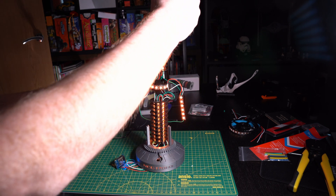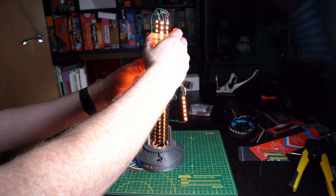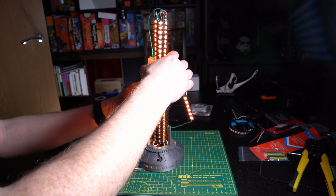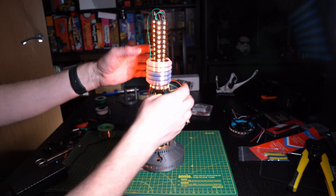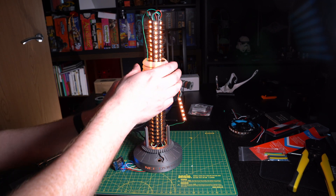Carefully slide the core parts over the LED baffles. You want to make sure you don't snag any of the wires as you go, else you'll be doing a resolder job. It's easiest if you hold the side LEDs which are kind of loose on the back, in the gap that's been made for the wires to run through. That keeps them out of the way — there's not a lot of space otherwise.